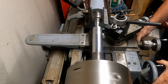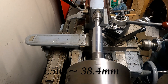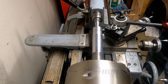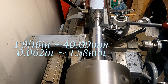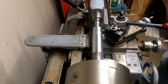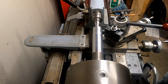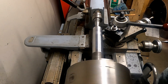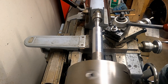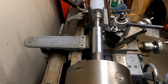Here we go with the new tool. I'm shooting for a nominal one and a half inch diameter on this part — a few tenths under, but inch and a half is where I'm going. The material was originally one and nine-sixteenths in diameter when purchased, so I've got about sixty-two thousandths to take off. Taking about a twenty-five thousandths pass here; it seems to work pretty good with this tool. I'm getting a better finish on the surface, moving kind of slow with the cross feed to get a good finish.